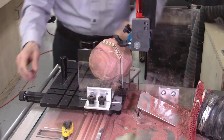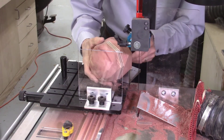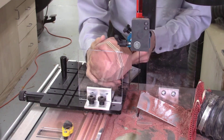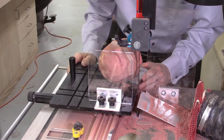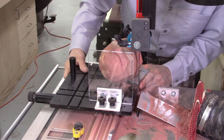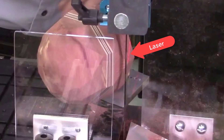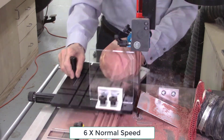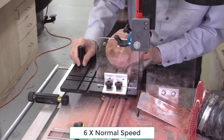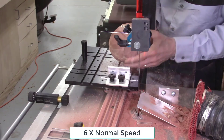From this camera angle it looks like you're going to be cutting into the base of the L-bracket carriage, but in reality you're not — you're cutting just to the edge of the wood which is in front of the L-bracket carriage. You want to be careful not to push the blade well past the end of the board. This laser beam works nicely for showing exactly where I'm cutting. When using the AccuFacet system, always use the safety shields, keep them in front of the bandsaw blade so your hands are protected when adjusting the board. Also always use the handle on the outside edge of the AccuSled to push the boards to the bandsaw blade.